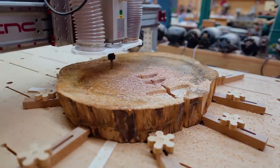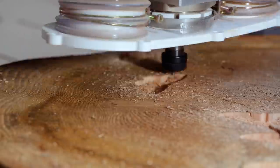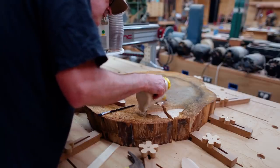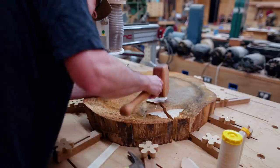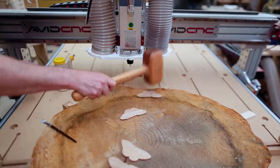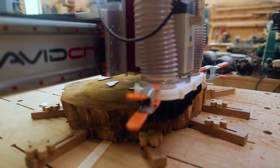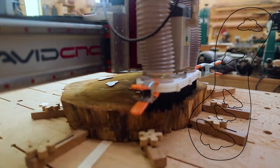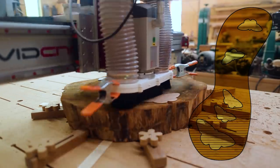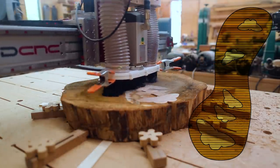For holding the workpiece on the table I just put my hold-downs along the edge of the piece of wood and used the weight of the wood to hold it down, preventing it from sliding around. I glued the butterflies in place — these went in fairly easily. There was space for the air to get out because of the crack, just snug enough that I didn't need to clamp them. Then I flattened the top, drawing a shape around the butterflies first to do just that area with a couple of passes, as they were a little higher than the surface.